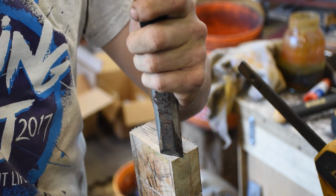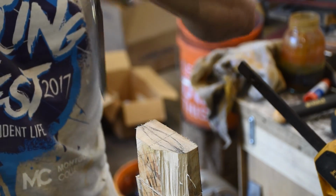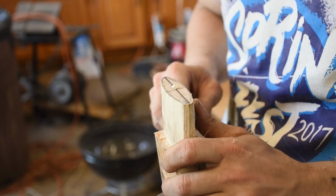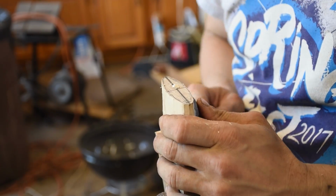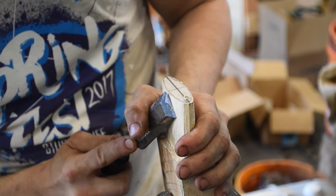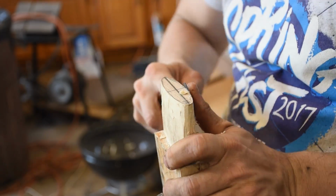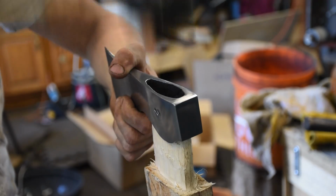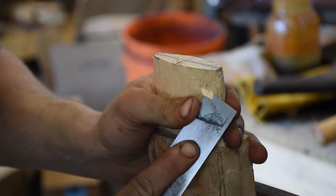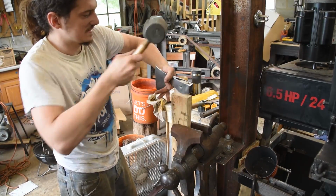And be mindful of the way the wood grain is gonna wanna make the chips split out. It's really nice and straight, you don't have to worry about it too much. It's slightly angled here, as you can see. Now I don't remember exactly why I decided to do this with the chisel, other than maybe it'd be easier to show, I guess. It would definitely have been faster on the grinder. Of course, you can overshoot on the grinder really easily. Anyway, once you get it on there, you pound it on, and you can see that mark in the wood. You just start carving away the pieces that are marked by the metal, till eventually it fits on nice, and it's on to the next step.